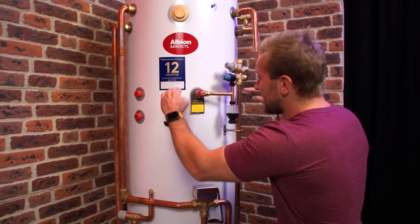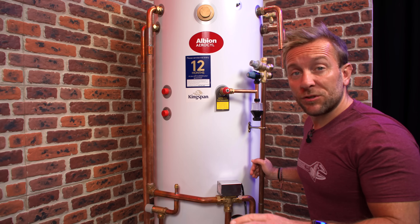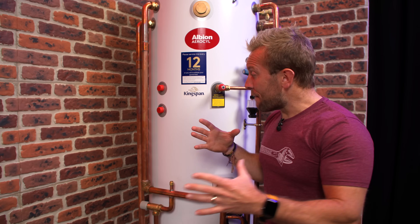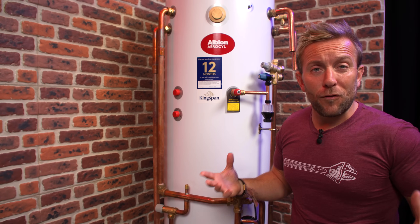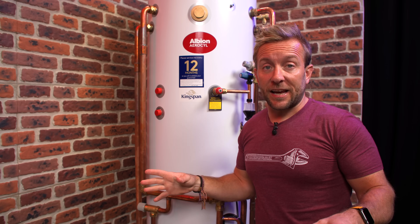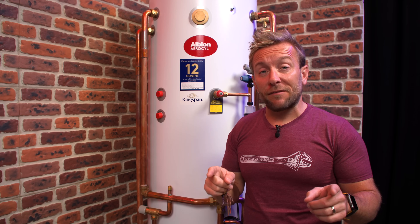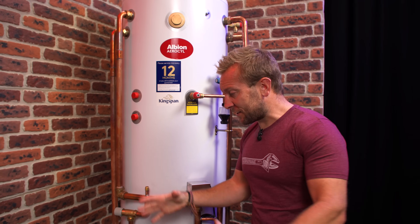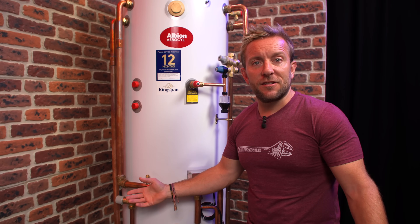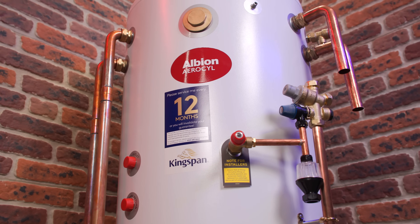So what we have here, we've actually got two tanks in one. Up to here we've got a hot water tank — a standard indirect hot water cylinder — and this will take 240 litres of hot water. Now imagine a separate buffer tank that you'd have to find somewhere for in the cramped environments of a new build house or an older property. The great thing about the LG Therma V is that you can use this system on older properties because you don't have to upgrade the radiators or install underfloor heating. The buffer tank is actually at the top up here — you've been looking at it all along, it's part of it already.